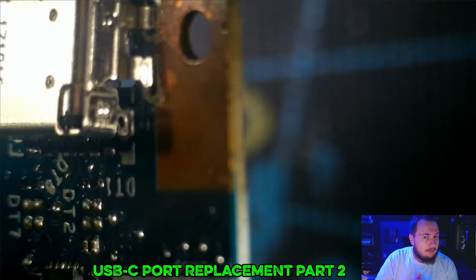So looking at this frame that I've frozen here, there are three things that are working against me when I'm trying to actively get this USB-C port in. And in this one picture, you can actually see all three of the things preventing me. But because I was so focused on just one thing, I only focus on that. So the three things that are actually preventing me from putting this in are the rear leg, which is what I'm focusing on, the back support leg that goes around the pins, and then there is a pin on the bottom that is sticking up that is physically making contact with the motherboard, preventing me from physically slotting it down.